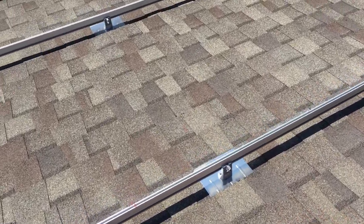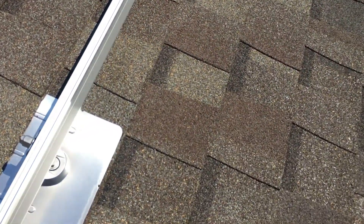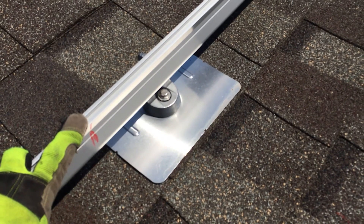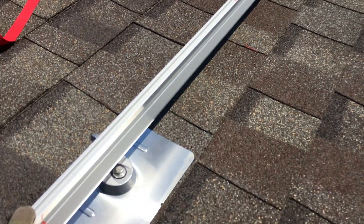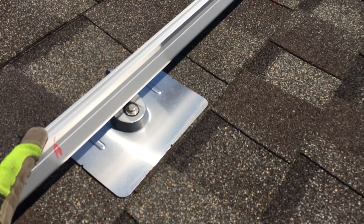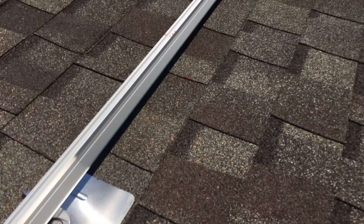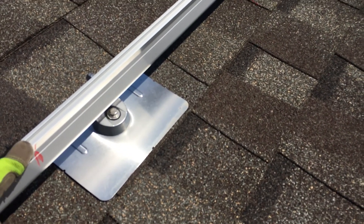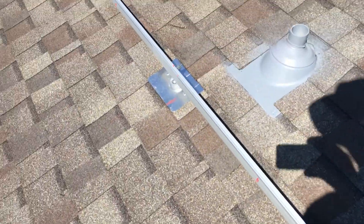Back up on top of the roof. We've marked the location of each of these micro inverters — three feet three and a quarter inches for each panel, plus a spacer for the UFO mount fasteners, making it six feet seven and three quarter inches overall. We used a crayon to mark the middle of each of those spaces to get the placement for the micro inverters, and got our marks for all the panels.